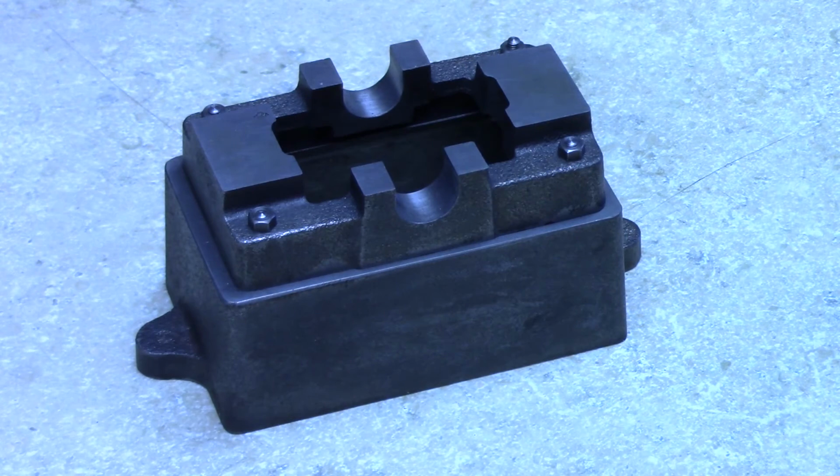For the final assembly, I'm going to use washers underneath the nuts because that surface will be painted and I don't want to damage the paint when tightening them. And the studs will need to be Loctited into the box bed because I noticed they tended to rotate as I was trying to tighten the nuts. But the holes fit very nicely, everything just slipped right together.